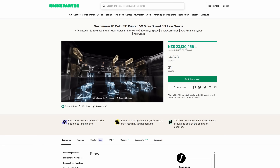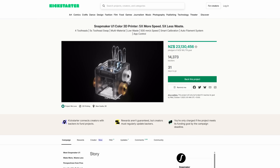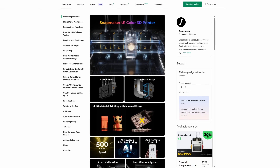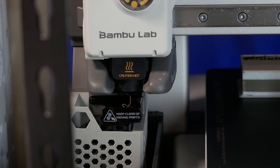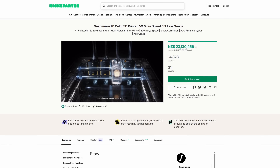Where I personally get really excited about multicolour FDM printing is actually the next stages of this technology. Even as I was planning and recording this video, we had some awesome news drop in this space. The Snapmaker U1 has launched on Kickstarter — a more affordable multi-headed printer seemingly aimed to rival the Prusa XL, proving that multi-toolhead colour changes are likely the way forward. For those who don't know, a multi-toolhead printer is, as the name suggests, a machine with multiple toolheads in a single printer — rather than swapping filament in a single nozzle, the printer can simply swap over to the printhead with the next colour, eliminating the need for purge material.